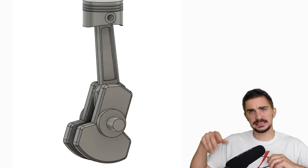Based on simple physics, my suspicion is that peak torque occurs very high in the rev range and that low-RPM torque is disappointing. Consider a single-cylinder 600 cc motorcycle engine versus a four-cylinder 600 cc motorcycle engine: the single cylinder has one big lever and one big piston producing a significant torque burst, giving good low-RPM torque. The four-cylinder has tiny levers and tiny pistons, requiring many tiny bursts to accumulate meaningful torque — which is why a typical four-cylinder 600 cc motorcycle engine has weak low-RPM performance and peak torque very high in the rev range.